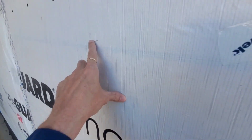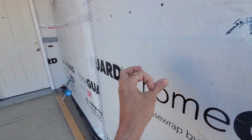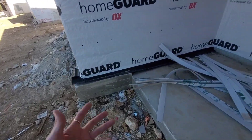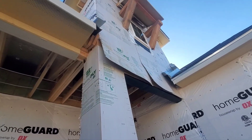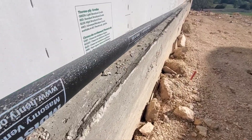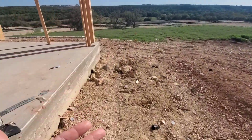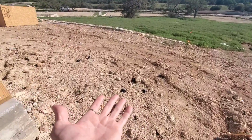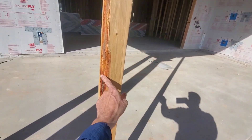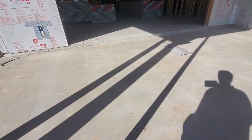I can see that they've used the wrong fasteners. These are okay to put up, but these are considered temporary. You've got to have the plastic-capped fasteners that give a larger surface area. All the manufacturers require plastic-capped staples with a larger head for greater surface area. They don't always have to be plastic-capped — they can be the type they use on the roof, but I never see those used on this. Obviously, they haven't finished fastening all of this cellulose fiber sheathing, so that needs to be fastened. Again, with this ledge — this little lip on the side of the brick ledge — that's a big no-no. In the framing stage, these guys always put the pretty side of the wood up, and the ugly side goes down where they can't see it. The problem is, this gets filled up with concrete and leaves that little lip. That needs to be fixed.